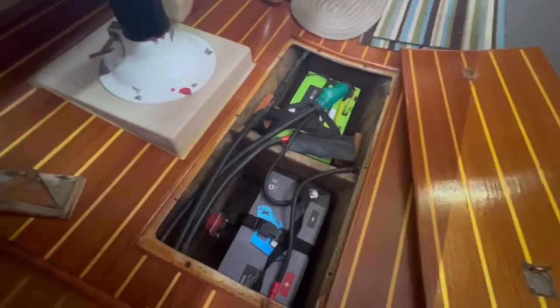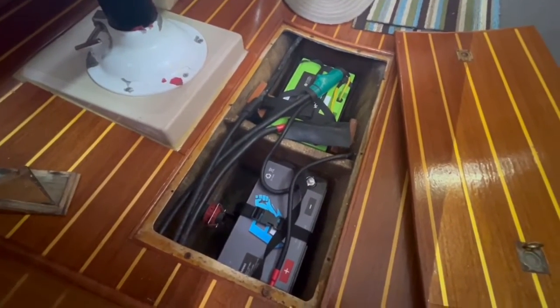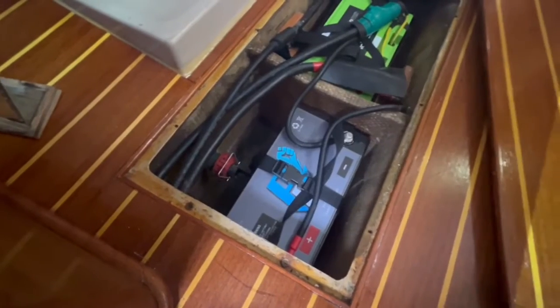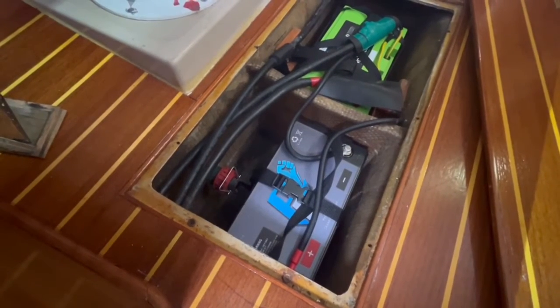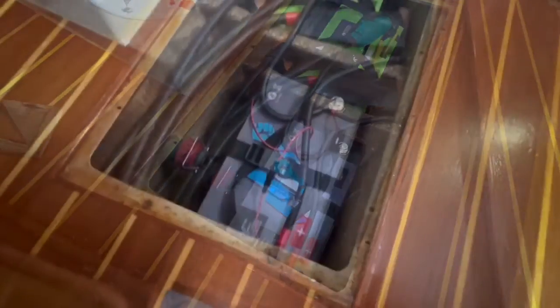In the cabin sole I've got this little hatch and down in the bilge I've got two 31-series batteries — both lithium but different brands, one's Powerhouse and I think the other is Valencia or something like that. They're commoned up together. I'm going to mount the Victron Smart Battery Sense onto one battery so it can Bluetooth up to my MPPT charger.